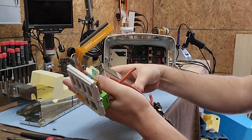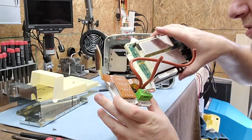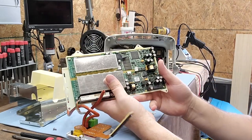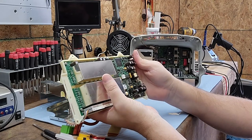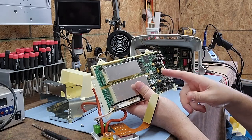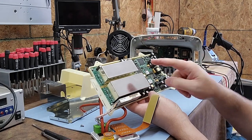I'm just unplugging stuff as I go. Now, just like I showed in other videos, anytime you have capacitors and inductors you've got power phases. You're also going to notice a separation between where the patient comes in and everything else — usually along transformers. There's normally an isolation between the patient and the mains and the electronics, and it looks like that separation is going to be under these shields.